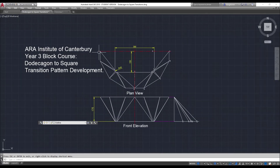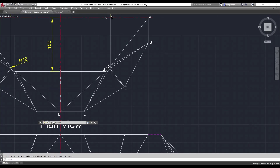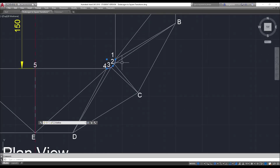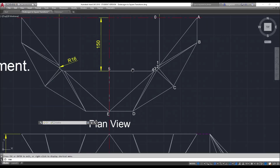I've drawn half of the plan at the top here, because you only need a half — in fact you only need a quarter on one side to develop it out. That's the plan view. On the bottom, the front elevation is 175 millimeters high. I've numbered everything on the inside from zero through to the radius on the corner, which has three even distances around it.